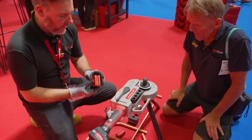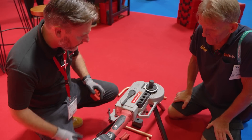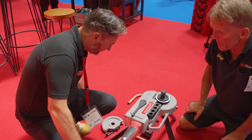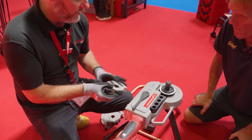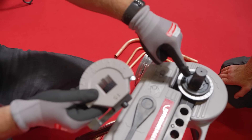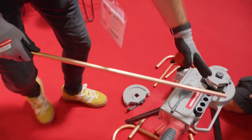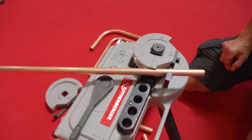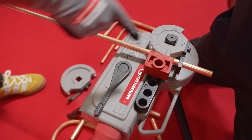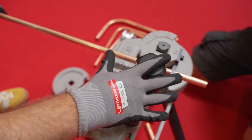So you've got the bend shoes — we've got 15mm here, not as exciting as doing 28mm and 35mm, but you've got to save your tube a bit. So your formers — that can only go on one way, there. Then this part here, knock it through, put your pipe through there, and then you've got your bend shoe, first hole as it's 15mm, put that through there.